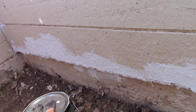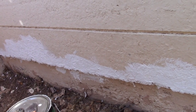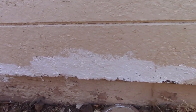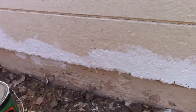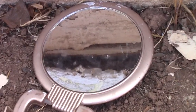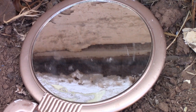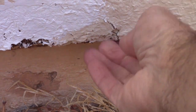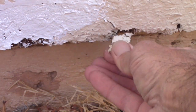As part of that stucco preparation work, I'm touching up these masonite walls. I've got two or three masonite walls in this house. I've painted the parts where the paint had peeled away, but also on the bottom you can see they didn't paint the bottom edge. That allows moisture to come up from the bottom and weaken and compromise the stucco. Over here you can see it's been weakened by the moisture and it just comes apart.